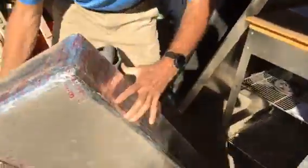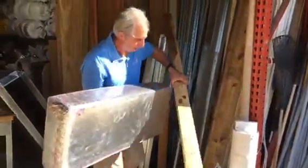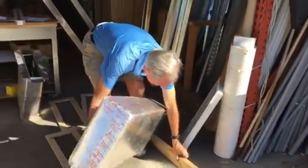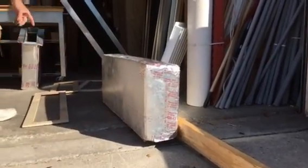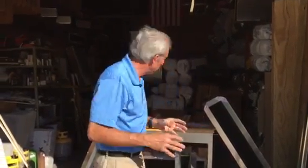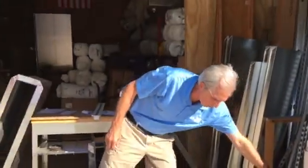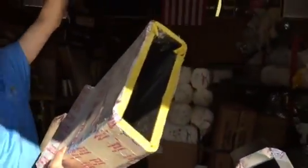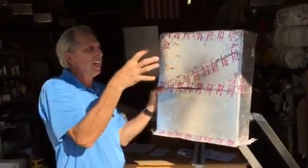Here are just a couple of cans from past jobs. Sometimes we make them high because the can has to come up high enough so you can get your collars in. When it comes to collars, you really don't want to use more than a five or six inch collar to feed these, because basically you've got 50 CFM per square foot and to keep it quiet you don't want to oversize them. On a larger diffuser you might be able to hit it with two sixes, but we'll talk about that later.